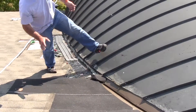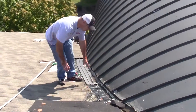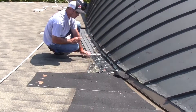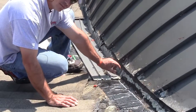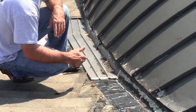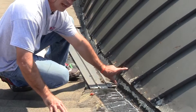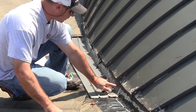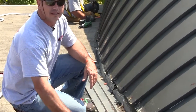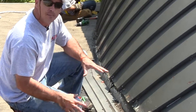Now before, they had previously had a channel designed for this product, but the only problem with this channel is it only goes up a couple of inches. And another problem is rather than having an extender flashing to make this flashing longer, they've caulked the edges — and that was the waterproofing. That was designed to keep water out of the inside of this building. It's a bad plan.